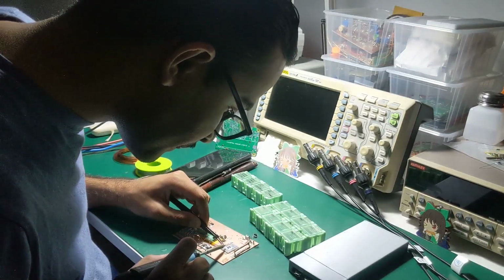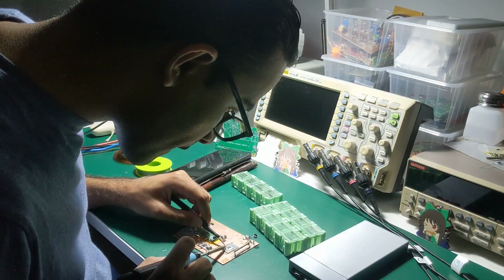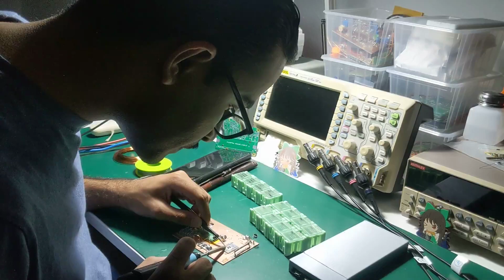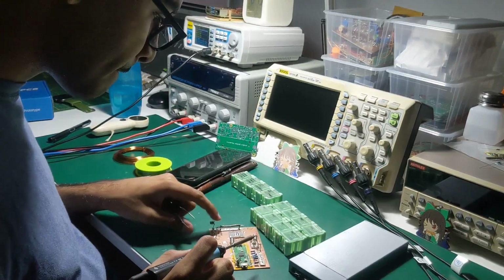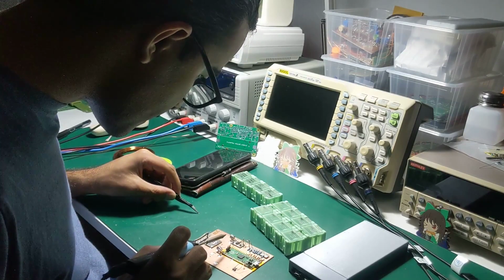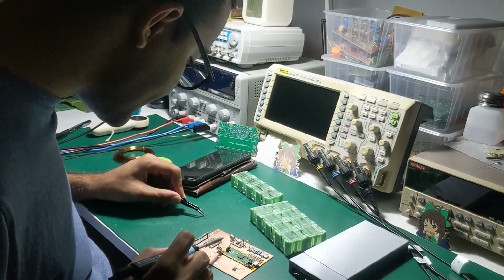That reminds me of the oscillators I made. Did I mention I made like a 220 megahertz oscillator on a perfboard using a BC transistor? That's how you make 5 megahertz 555 oscillators, you just don't add a capacitor. The perfboard was the capacitor. Exactly. There are people who just use the on-chip capacitance between traces. Yes, a lot of RF transmitters do that. That's why they tell you to use shitty transistors to have the capacitors. I'm not joking, you can see the capacitors missing from the schematic.